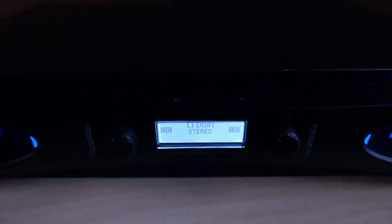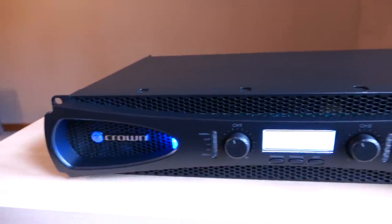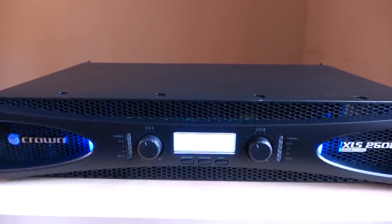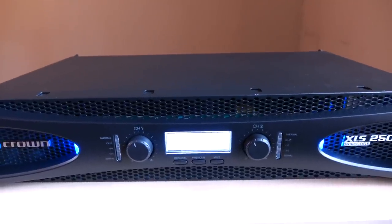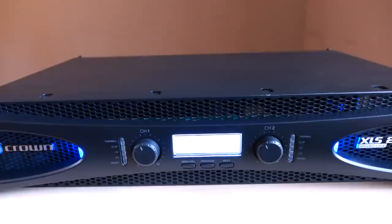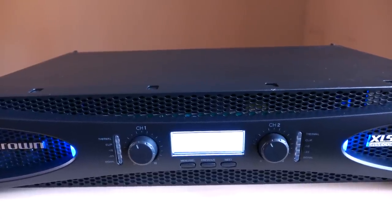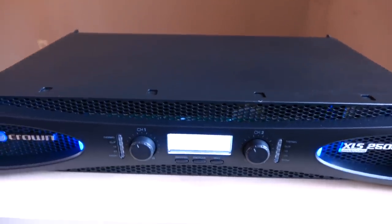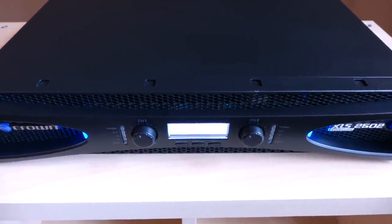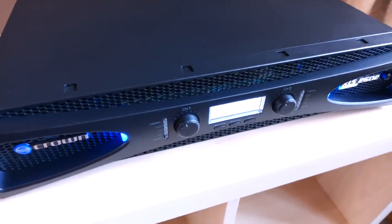There's also a menu system. Without going through every detail, here's a summary: you can disable the blue LEDs and turn off the meters if you prefer. The screen will turn off after a couple of minutes. Most importantly, there's a built-in crossover network, allowing you to adjust any frequency point between 50 and 3,000 Hz — very useful for home theater applications, such as filtering deep bass from a center channel.